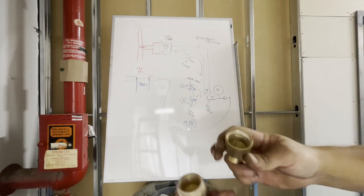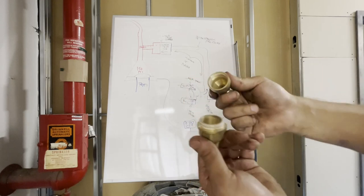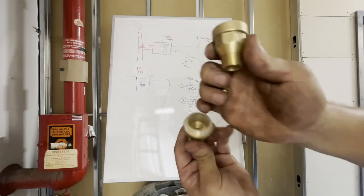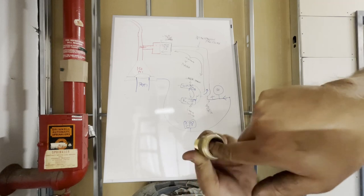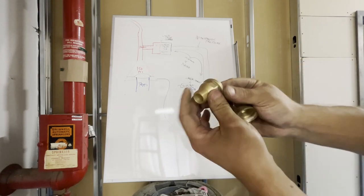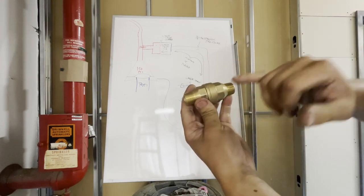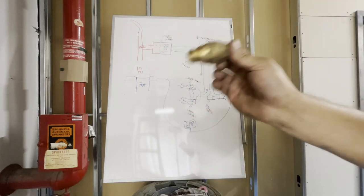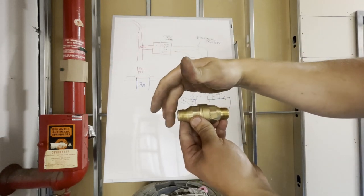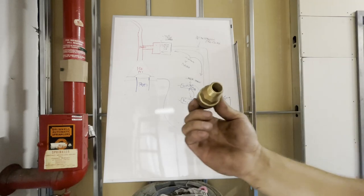You can see how it concaves up in the middle and tapers back down. There is a ball inside it. It's nicely and evenly shaped — you can install these in either direction; there's no inlet, no outlet, no direction for installing them. Kind of shaped like an ice cream cone. When that ball is ever under pressure, that ball pushes up against that concave — it's a perfect fit — so it will seal up under pressure and will not let water shoot out of there. When it's under pressure from whichever way, that ball is going to push one way or the other, whichever way the pressure is coming from, and seal up the discharge side.